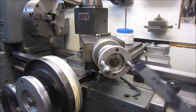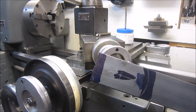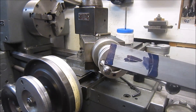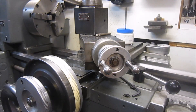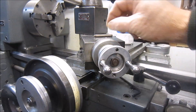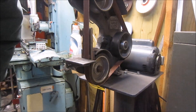I dug around in the scrap box and grabbed a piece of metal — it's a nice width for there. Since I got my Dykem bottle brush fixed, no more barking about that. I got some Dykem on there and laid out the radius and got me a center point. I'll go over and cut and grind these to fit. In the background I've got a set of transfer punches — I'll put the transfer punch in the hole, hold it up there, give it a little love tap, and that'll give me my hole centers so I can drill and use the 10-32s to attach.